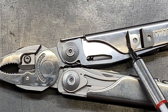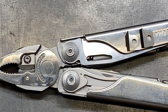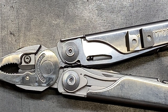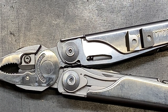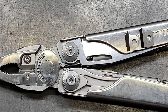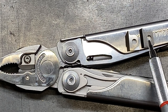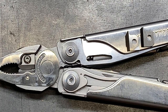What I'm thinking about doing is using the EOD cutters. What I'll have to do to make them fit into the Surge is radius this edge just enough so that it will bypass and seat into the Surge plier. By doing that I don't have to sharpen the edge. I thought about trying to sharpen this edge to make it a better wire cutter, but because it's so small it's so hard to get to. With the EOD version I can radius the edge pretty easily by setting it in the vise, and then come in with a file and create my own notch for the hard wire cutters. So I'm going to order another set — these came out of my Leatherman Mutt EOD — and we're going to try it with the EOD version.